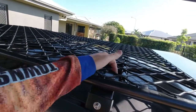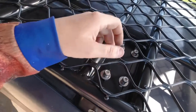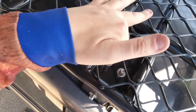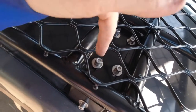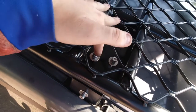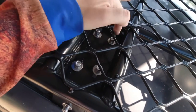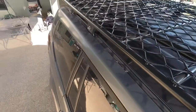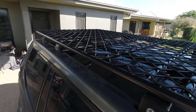Once you've got it centered, go around and rattle all the bolts down. While they're still loose, slide them within their slots to where you can reach them with the Allen key in the impact gun — they might need to be staggered so you can access each one. Move them while loose to where you can get to them, then it's easy to tighten. Let's get that done and show you the finished product.